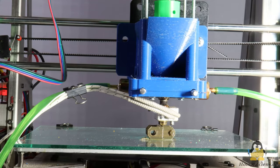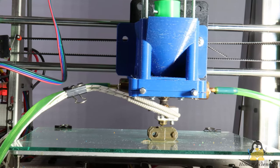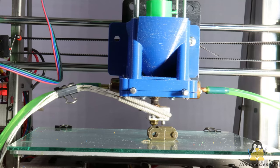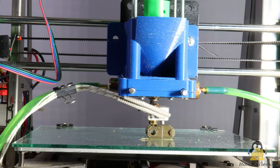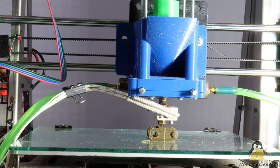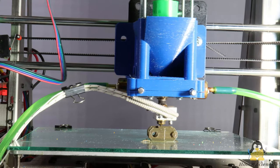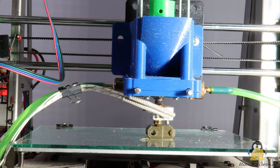In the previous video I said that the next thing I wanted to do was talk about optimizing the thermal design of my extruder. Version 4.1 doesn't look that much different than the extruder shown previously, but it's another step in the right direction. The copper pipe for the water cooling is now sealed by soldering, so water no longer drips out even during intensive use.